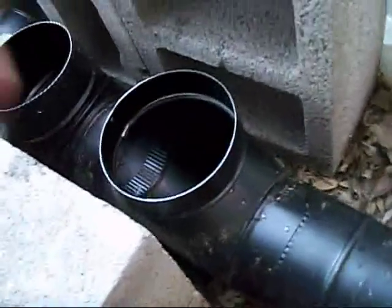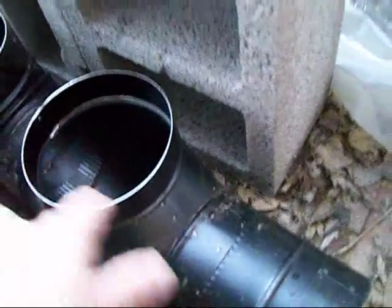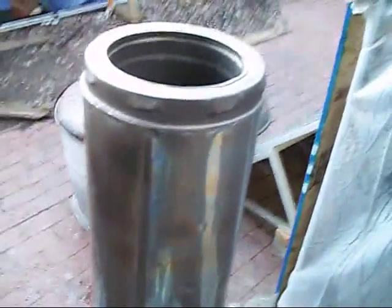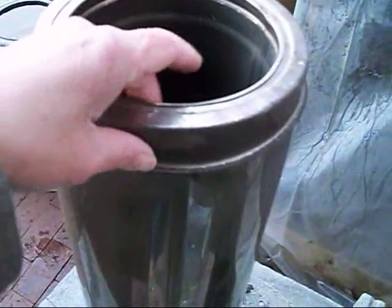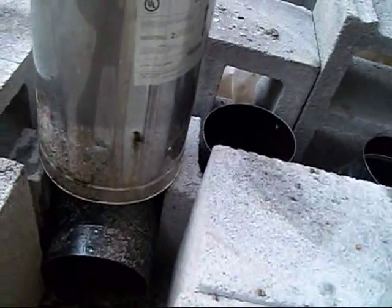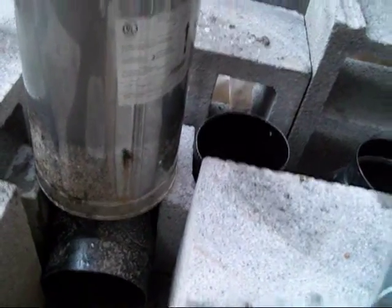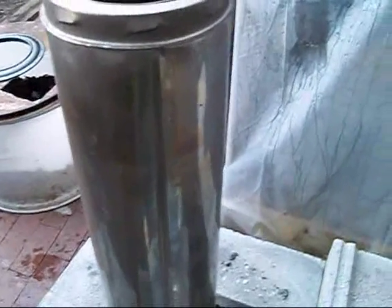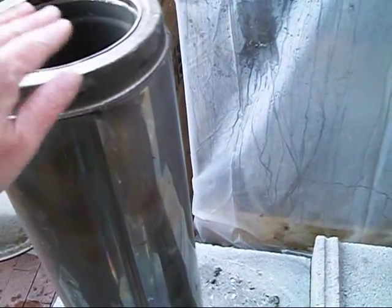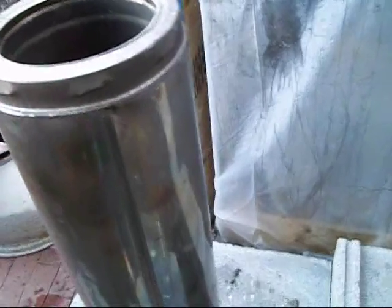Down here in the bottom — let me show you its twin. This here is black furnace pipe. It's a T. I've got another one of those right here that is going up into this six inch inner diameter insulated section. It's three feet tall. So you're going to see it's resting on those two eight inch tall bricks, give or take. I've validated that when I put the 55 gallon drum over top of this, there's about the two-inch bit of a two by four height between this and the barrel.